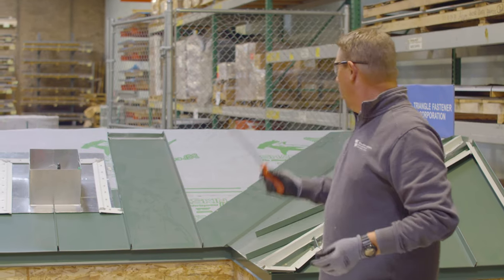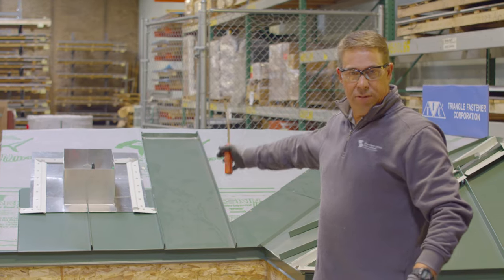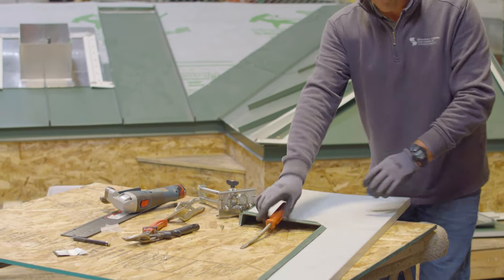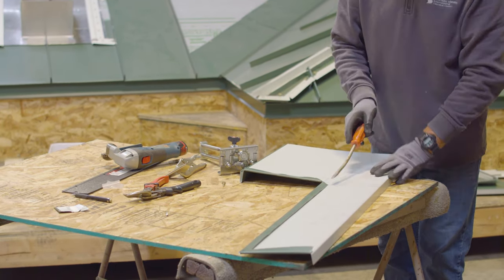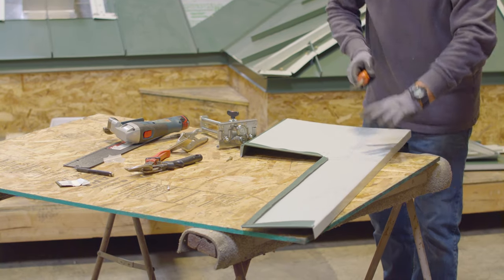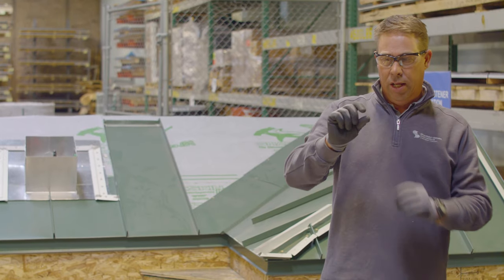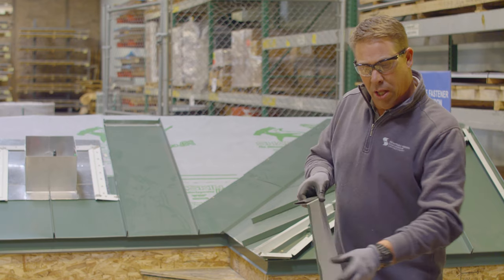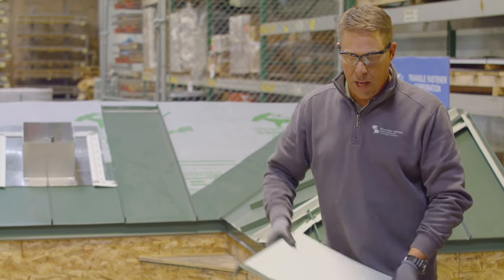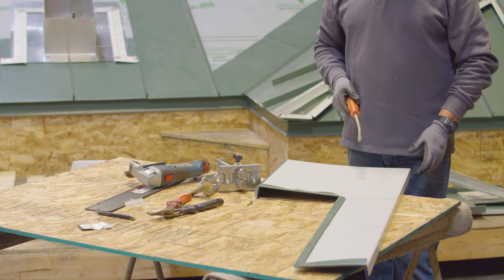A quick tip for going up the side wall of the curb on the offset cleat: close the hem basically all the way down, take two 2x4s — whatever the height of the panel is — and smash this down pretty much all the way, then take a screwdriver and open it up. That'll open it to almost exactly a quarter of an inch, which will hold everything tight. Many times we see a deflection of over a half inch from the edge of the panel to the base of the curb flange. Use this method, flatten it out, run a screwdriver right down it, and you'll end up with a better result every time.